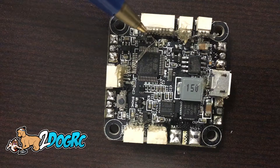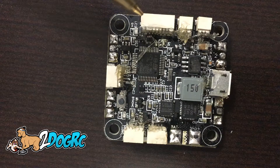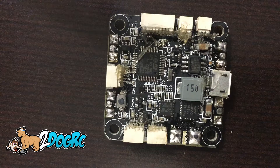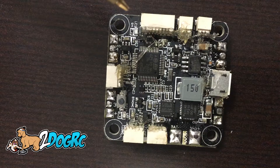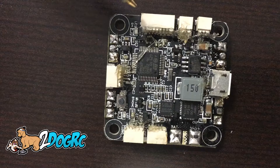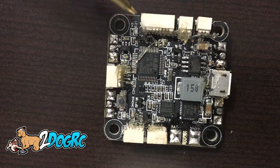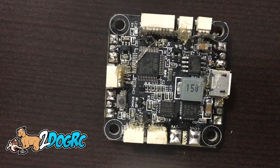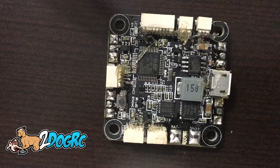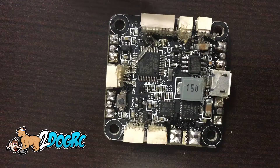So like if you're using a receiver where you have to plug in one wire for every channel — you've got ground, 5 volts, then channels one, two, three, four. And then you've got your LED for the WS2811 or WS2812 LEDs that are programmable — that would plug off of there.